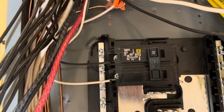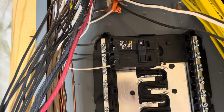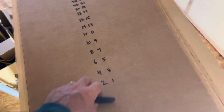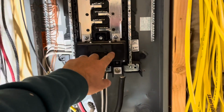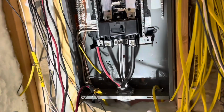All right, so I've put the first breaker in and wired her up. It's the Coves, bedrooms 1 through 3. 20 amp double pole that takes the black and the white wire. And then I've started labeling this. I just realized when an electrician friend came by, he said, I always like this up at the top. That way a kid can't reach up in here. Not that a kid would ever be in here, but anyway.